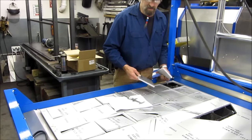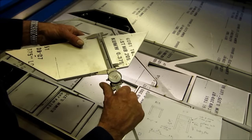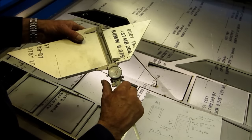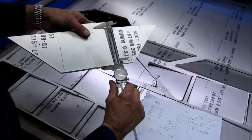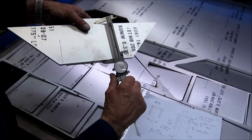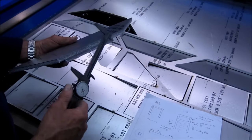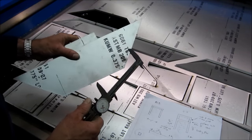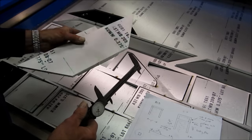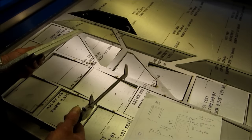because our widths that we're looking for in here, like this right here, 4.560. It was supposed to be pretty close to 4.580. If we suck up the whole thing down close to the bottom, we're like 4.600. So I mean, we're definitely within welding tolerances, and that's what we're shooting for, is to be able to cut aluminum plate like this. We had 24 successful pierce points.